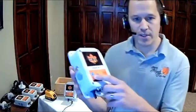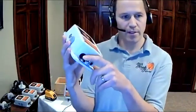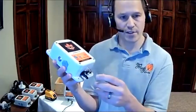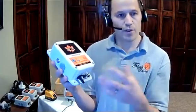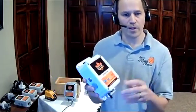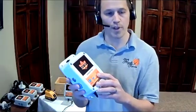So Sap Spy is an all-in-one device. This one device will measure vacuum, tank level, temperature, and is also cellular connected. To measure vacuum, it's a simple 5/16 port on the bottom of the device. This is typically connected right at the releaser or the woods side of the releaser. This allows you to know that your vacuum pump is on and working properly, that your releaser is also working properly, and that the vacuum at your woods is at its peak performance. Kind of gives you peace of mind knowing that your vacuum is working properly.